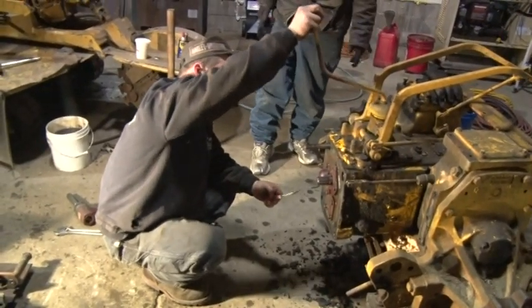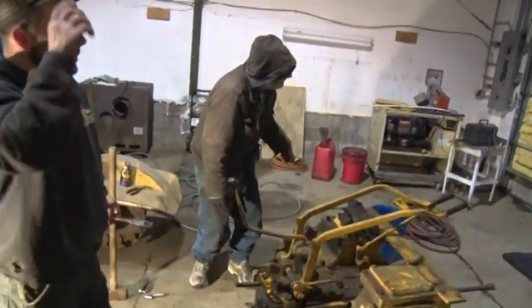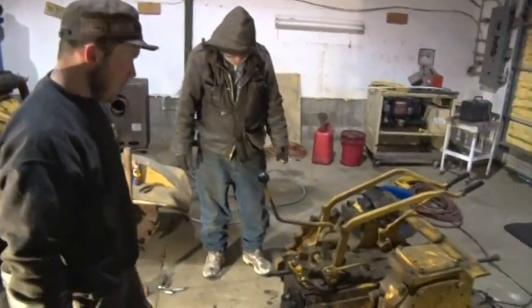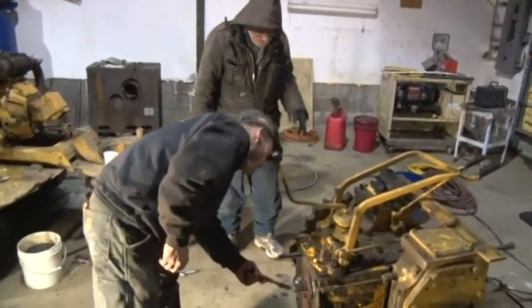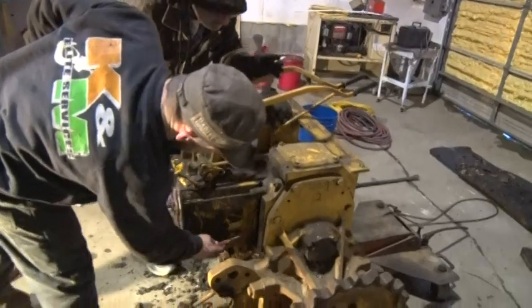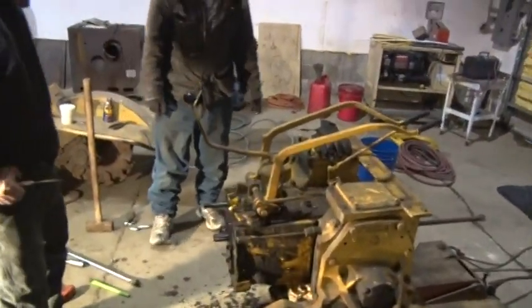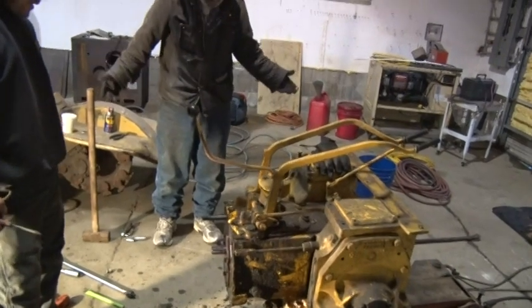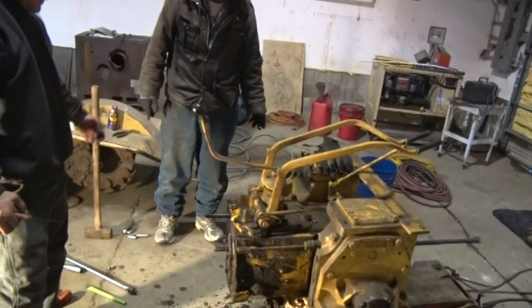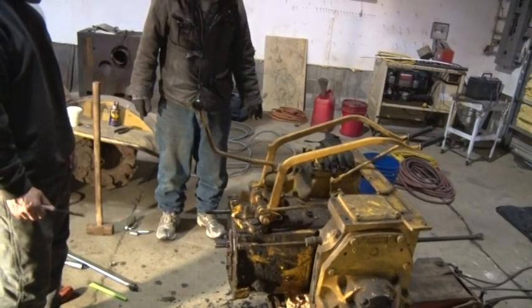This whole top plate's loose. Well, without the top plate bolted down fast, it takes away its structural integrity too. So when it's broke down here, it disappears here. I was just showing Dean. And it starts over here, comes all the way down, forward, and disappears under there. And the only proper way to do it is to gut that transmission and weld it. You can't weld it with grease and oil in it. It's gotta be heated and cleaned, or I personally would like to bake it.